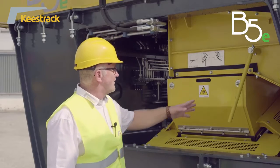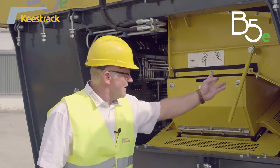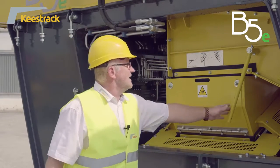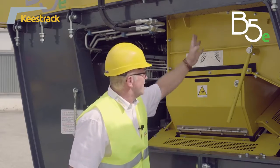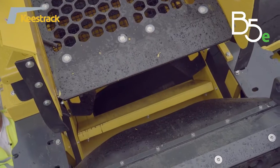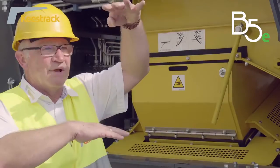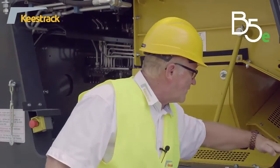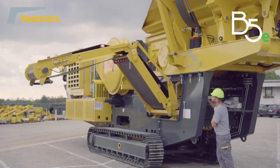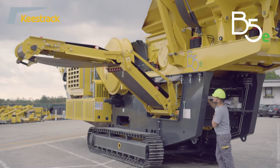To discharge the fine fraction either to the stockpile or in crusher bypass, we have here a chute with a flap, and then we can easily change the way of the material by just turning this flap. The middle fraction, what we see here, which means above bottom deck, below top deck, always goes in crusher bypass. The drive of the pre-screened stockpile conveyor is performed by an electric drum motor of 4 kilowatt.